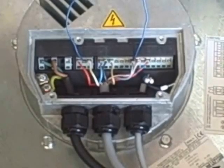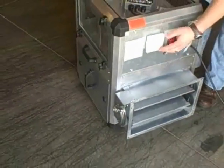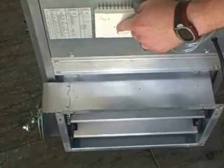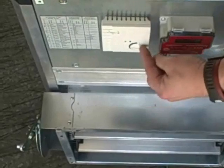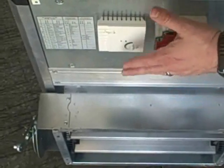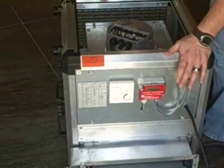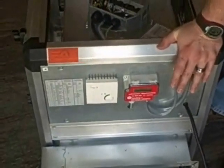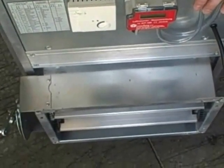Again, you'll hear the click and the fan will slowly start to come up to speed. The fan is now running at about 50% speed. On the potentiometer you've got your indicator lights — the green light would be on — along with the enable switch to turn the fan on and off, letting you run it really slow or ramp it all the way up to 100%. These fans run a 1 to 9.5 volt input range. Anything under 1 volt will stop the fan, and anything over 9.5 volts will run it at 100%.